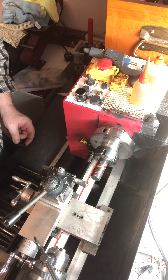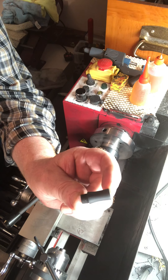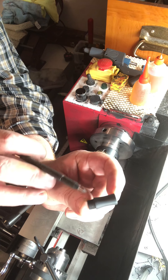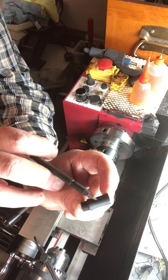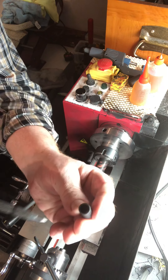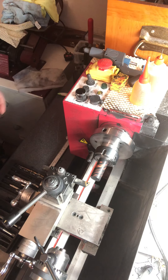Today we're going to make the pen section that holds the nib and the ink pump on the other side. This is one I've made already and I'll walk you through the process of producing this. You've got three distinct sections to produce, three operations: number one, forming the tenon with the M10 thread; secondly, forming the diameter and profiling to meet your personal needs; and finally the drilling and tapping of the inside that takes the actual nib itself. So let's get started.